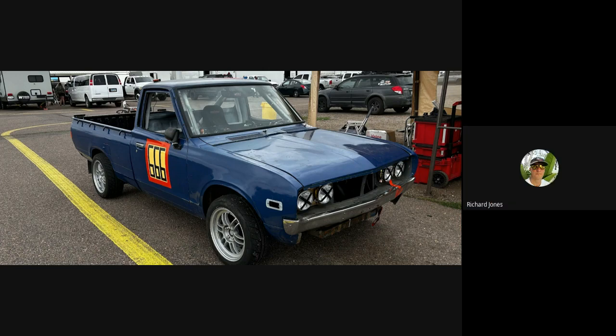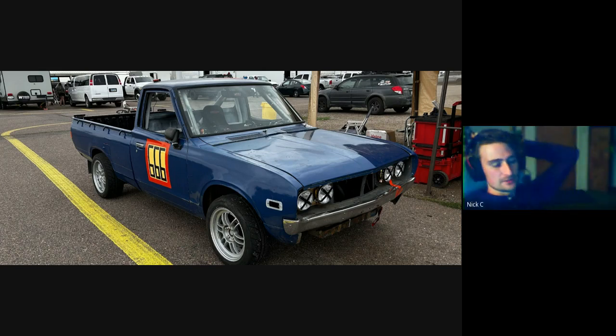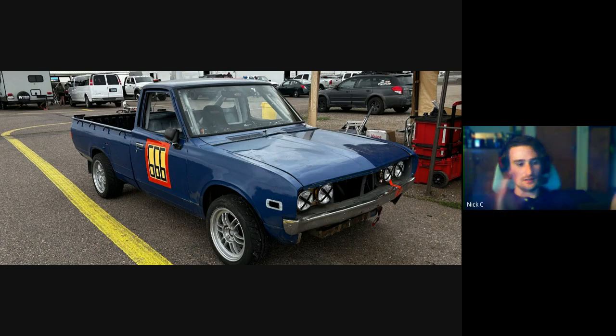Is there anything that would replace the Hyper 9 in the same form factor? Since you've got it all packed in there right now, is there a beefier motor out there that could be an upgrade? I think there's a few motors that use the same, I think it's the B face motor attachment. A lot of them would fit. I'd have to do a little modification to the motor mounts. I don't have the brand names off the top of my head, but there's several other motors that would fit. The voltage architecture becomes a problem. If we had to go to 400 volts, then our battery gets bigger. Part of the reason for picking the Hyper 9 was the voltage, because we were able to get this pack in a packaging where we can meet the 9 inches from the envelope of the car and make it in a form factor that we could swap in and out of the car. Getting up to higher voltages becomes a really big challenge unless you go with a totally different battery architecture.